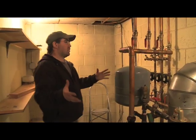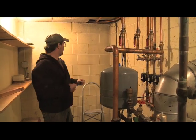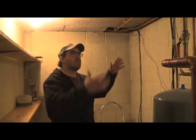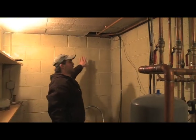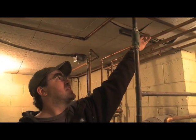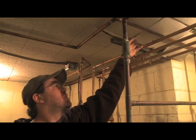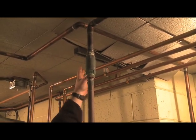So this is the boiler room. This is the space immediately below our work area from where we just came. Our new steel beam is above this old hearth slab. It gets supported on this foundation wall, and the end of the steel beam is approximately here. As you can see, we're just a little overzealous with the roto hammer making the access hole for our column.